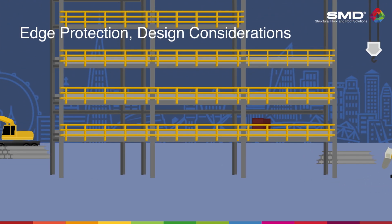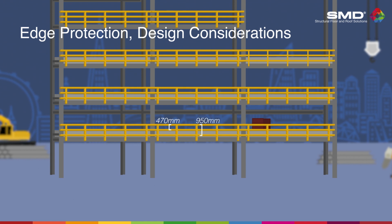Maximum gaps must be reviewed from the top of steel and the finished floor height. Gaps vertically should not exceed 470 mm. The overall height of the handrails should be a minimum of 950 mm.